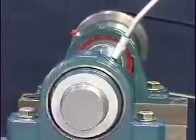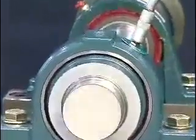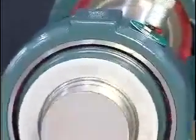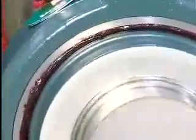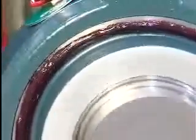If it's safe to do so, bearings should be relubricated while in operation to equally distribute grease throughout the bearing and minimize the temperature rise which may occur during relubrication. A good rule of thumb is to slowly add grease until clean grease is seen purging past the bearing seal. Imperial bearing seals are designed to purge excess grease from the bearing as the internal bearing pressure increases.